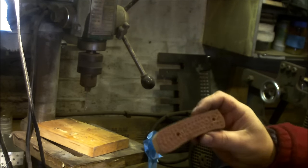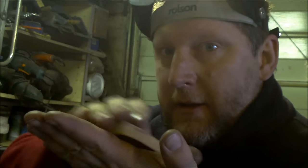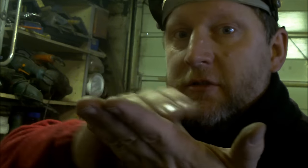So what I do is I do that to both sides, and then on a flat lap board, so a piece of Formica, or if you've got a surface plate, I put the abrasive on that, and then I take off all the burrs that have been created by the drill, so that it sits flat on the blank. So I'll crack on with that, and we'll come back after I've literally just gone like that, removed the burrs on the fiber liner or the G10,